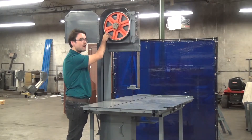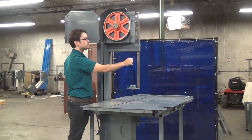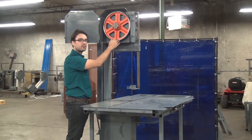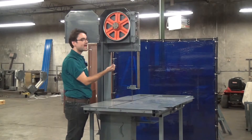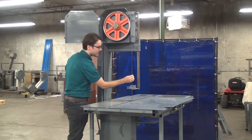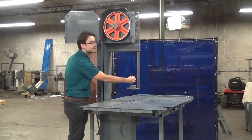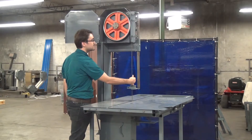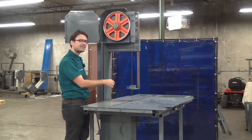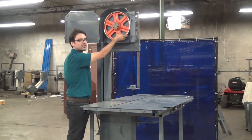Because of this crown here, the lean of the wheel will actually want to push the blade to the forward of the wheel or push the blade to the back of the wheel. When that happens, you might notice your blade coming out a little bit twisted to the left or the right, and obviously that's going to make for a poor cut. Today we'll look at the method we use to solve this problem and get the blade centered on our wheel.